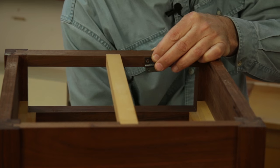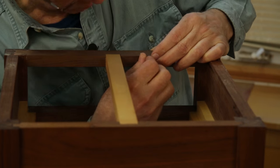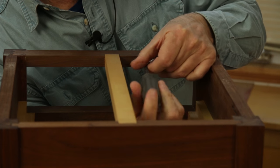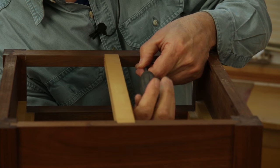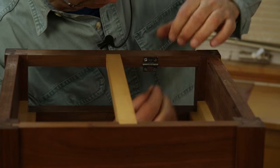Let's install a couple screws in here. I've already drilled my pilot holes, and you'll notice that I'm hand-driving these in. I tend not to power drive brass screws for risk of breaking them. So we'll put in our couple screws here.